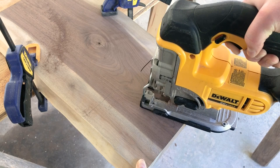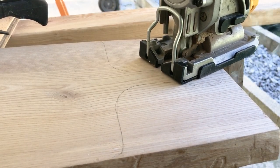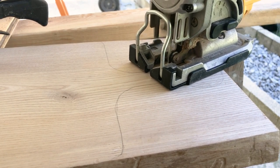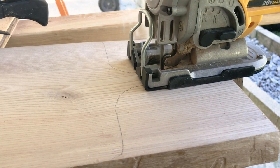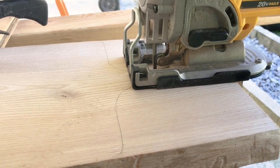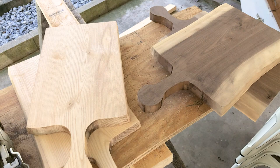As I'm making my cuts with the jigsaw, I'm being very careful to follow those lines as best I can. It's not going to be exact, but that's okay because it's going to match that sort of live-edge board we've got going. The good thing about using the jigsaw here is it doesn't have to have superbly straight, precise lines. When I sand it, it's going to add even more of a live-edge feel. I'm going slow, making intentional turns, being careful with my goggles on, going around through each board.